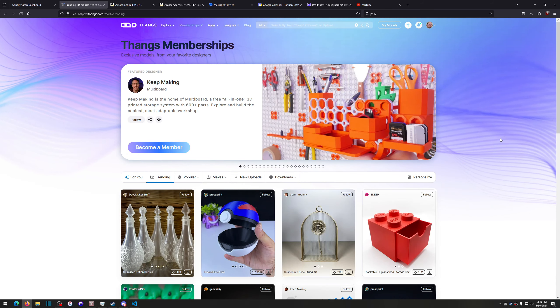Here we go, another 3D printing video. I've got my Creality Ender 3 V3 SE and I spent some time yesterday doing some prints. I already tore up my build plate because the prints stuck so bad I couldn't get them off. When I finally got them off by hand-prying, it pulled the top Teflon layer right off the build plate. I've got a new build plate coming — I'm still learning.